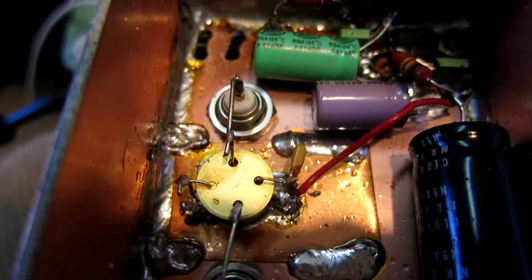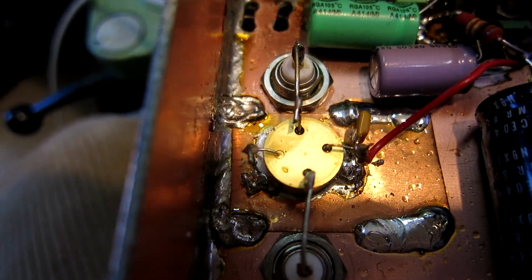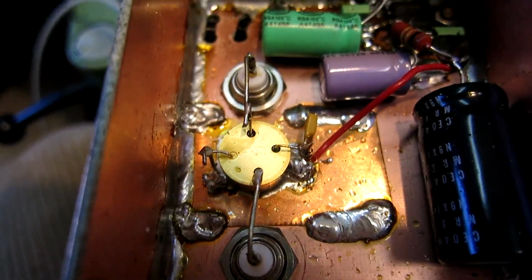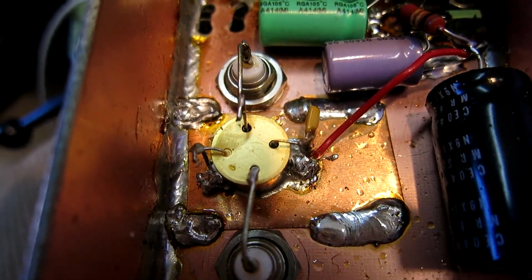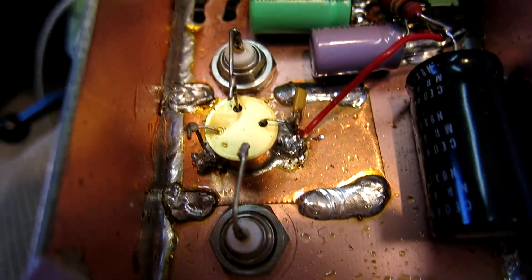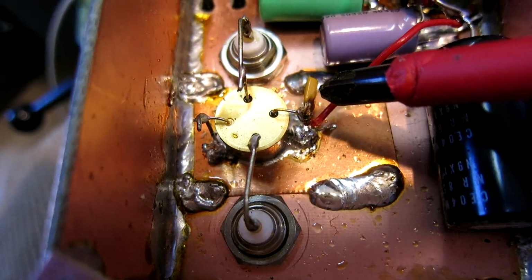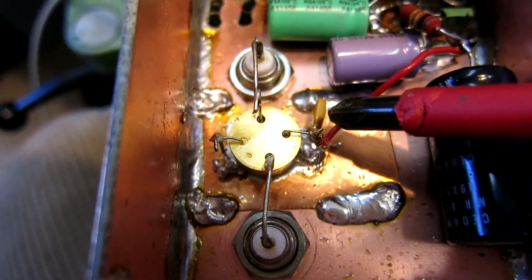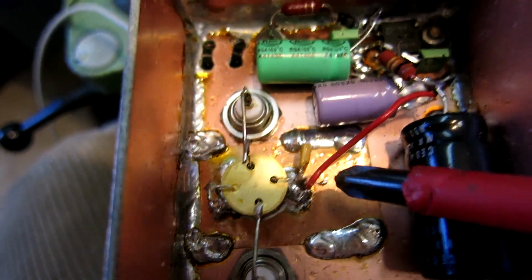This is an amplifier with a QBH1297, and it's a very simple thing. 2 connectors and the amplifier, and the amplifier is fed by 12 volts and decoupled here with a multi-layer 1 microfarad capacitor, so it should be well decoupled for RF.